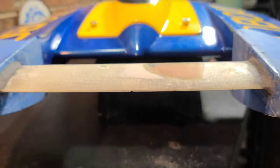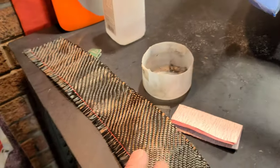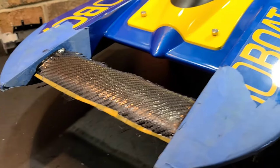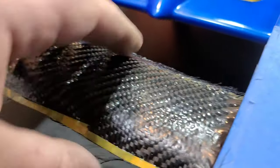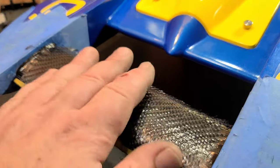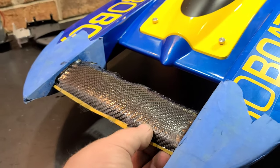I've got my winglet sanded and contoured the way I want it. I've plunged it to both sides so we can get a nice sharp leading and trailing edge. I'm gonna cut the cloth, lay it out, and show you what it looks like on the top side. It looks sick! I'll sand it, profile it, trim up the overhang, then coat with another application of epoxy, sand it, maybe another application of epoxy. Then I've got to cut all the excess off, do the bottom, trim it up, and join the two to make it look seamless.